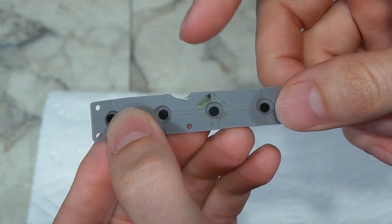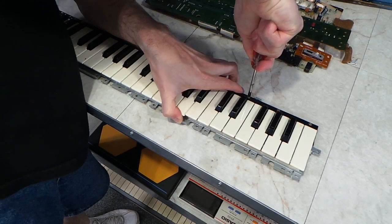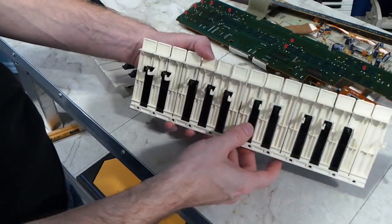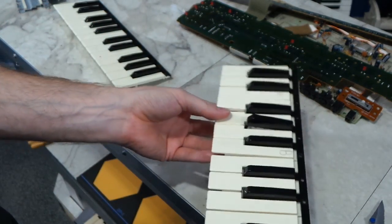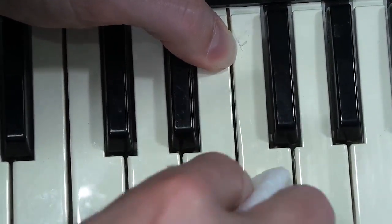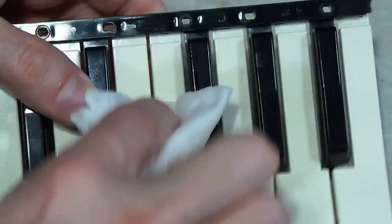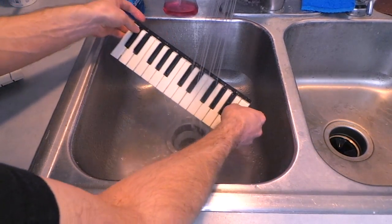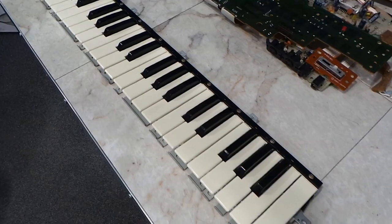I also washed the rubber sensor pads off really well in the sink — they were pretty dusty. However, one didn't wash off, so I tried some alcohol instead, and whatever it was cleaned off pretty easily. Now it was time to turn my attention to the key mech. This is a typical key mechanism from Casio during this time period — I've worked on several like this. However, after removing the screws, I could not remove the black keys — I couldn't separate the black and white keys at all. I think they glued them together at the factory, which I have not seen before. Alcohol is my number one first line treatment for stuff like this, and it appeared to work pretty well. I was able to remove the permanent marker residue, and eventually gave the keys a good rinsing in the sink. Here is the key mech reassembled and it appears to have cleaned up really well.